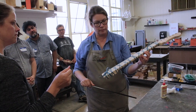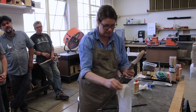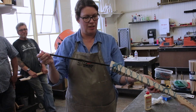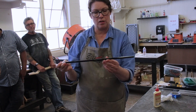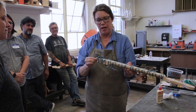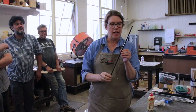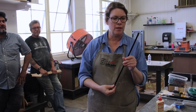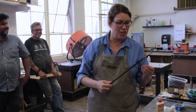The glue right next to the nut is a good idea to get off while it's still wet — it's easier now, even though we'll sand it later. One last thing: use the truss rod like a dipstick — insert it all the way in and when you pull it out, check for glue. There's really very little glue that got into the slot even without tape. If there is a lot of glue, wipe it off with the wet paper towel and keep inserting and removing until it comes out clean — kind of like sticking a toothpick in a cake to check if it's done.